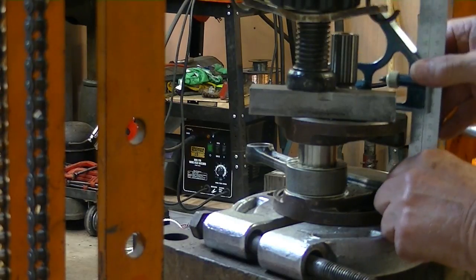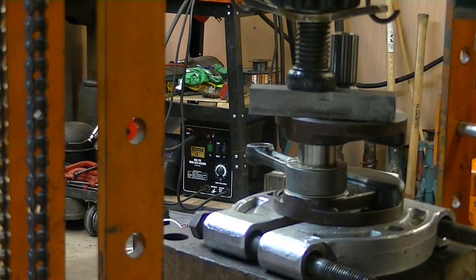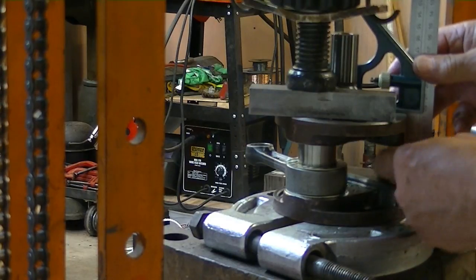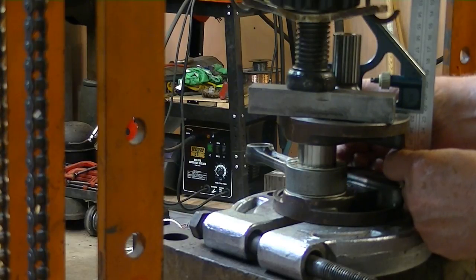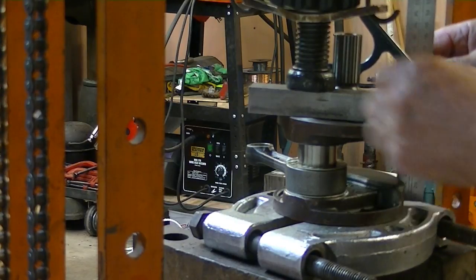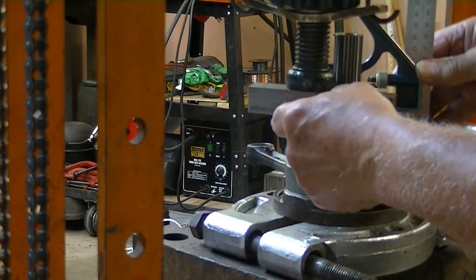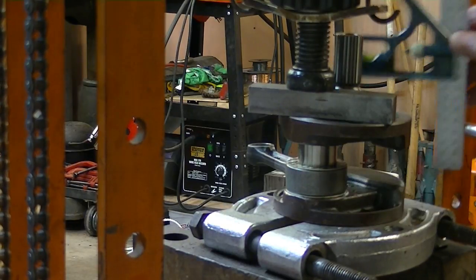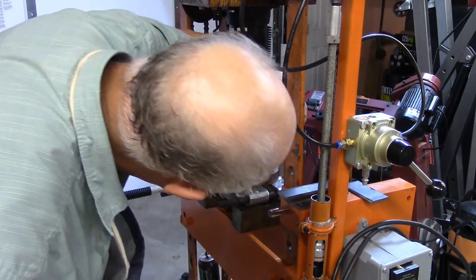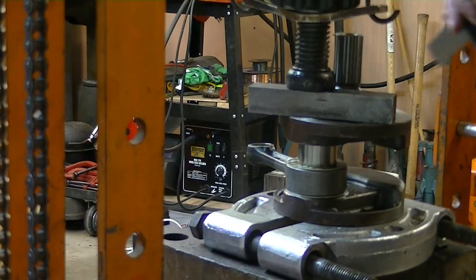When I was watching guys at a Suzuki dealer a long time ago, they were putting one-cylinder crankshafts together with a tri-square like this, and they would squeeze them together and that was all the straightening they got. But really you need to do a little more — put them between centers of the lathe and see to it that they're actually straight. I had a guy telling me about doing airplane engines. He said they just put them together and stuck it back in the engine and let them run straight. I don't know if that's a fact but it sure doesn't sound good to me.